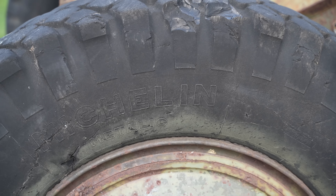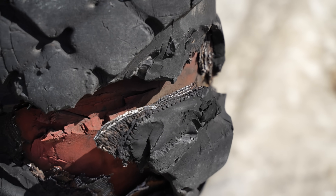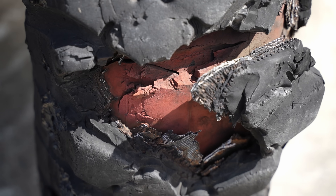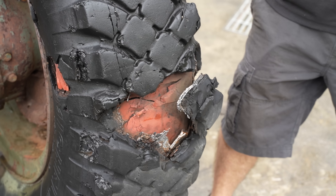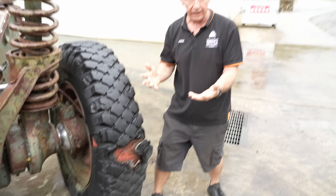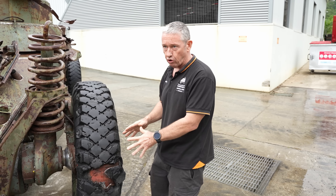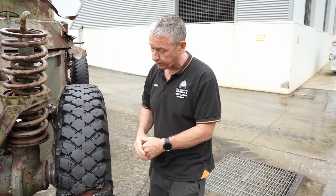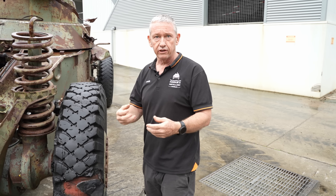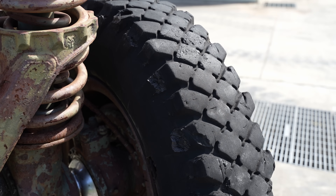The tyres are what they call the never-flat tyre. Essentially we have our rubber outer, and on the inside of that are cavities that are nitrogen-filled. So even if the tyres get hit with bullets and fragmentation, not all of the air will leave the tyre. The good thing about nitrogen, if we talk about operating in hot climates which France generally did in Africa, is that nitrogen keeps cool so it doesn't heat up like compressed air does, keeping the temperature of the tyre quite low.